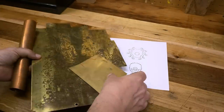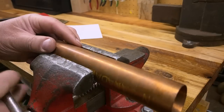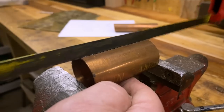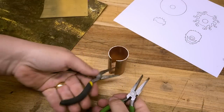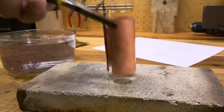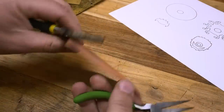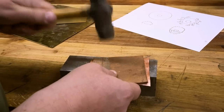For my materials, I'm using a variety of scrap brass and copper, some of which I had lying around the shop. This large copper pipe is going to provide ample material for the eye stalk base. I cut a section off to length and then cut it lengthwise so I can flatten it out. The metal is a little too stiff to flatten easily by hand, so I'm going to heat it up to red hot with my torch and then quench it in water. This process is called annealing, which softens the metal enough to make it easily workable. Then, using a small piece of steel as an anvil, I hammer the piece flat using a piece of leather as a pad to protect the surface.